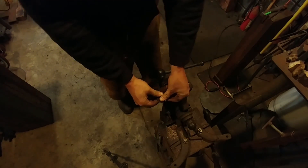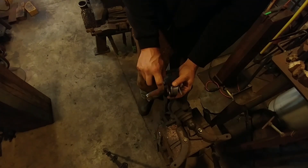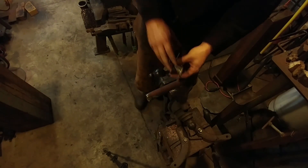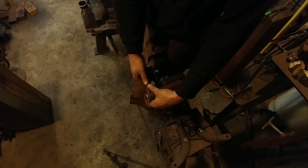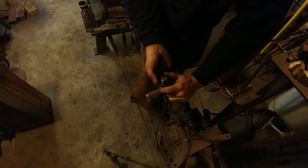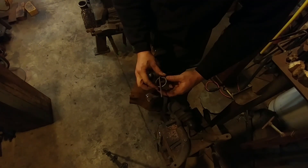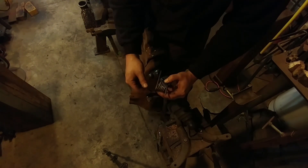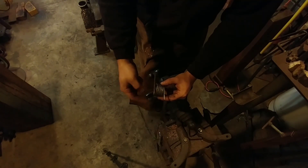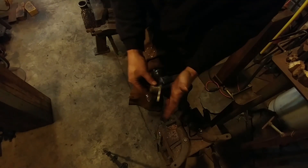You can see I'm doing it by hand. Once off the die, you can curl the end into a hook and create an extension spring, or use it for things like mouse traps or heavier-duty traps. Alternatively, you can cut the end off and grind it flat on both sides to finish it as a compression spring.